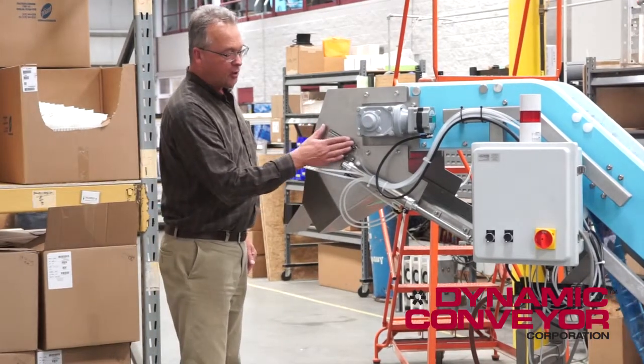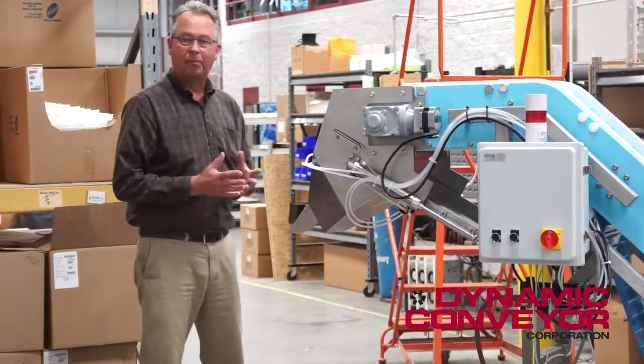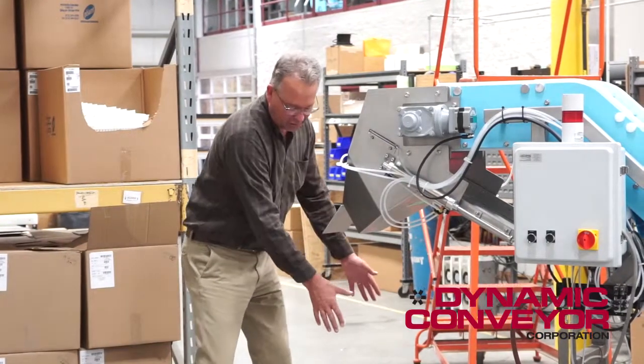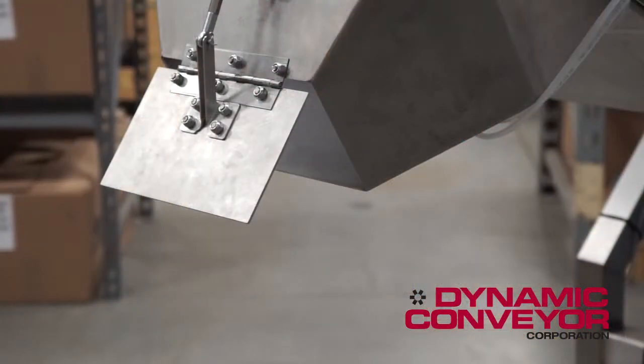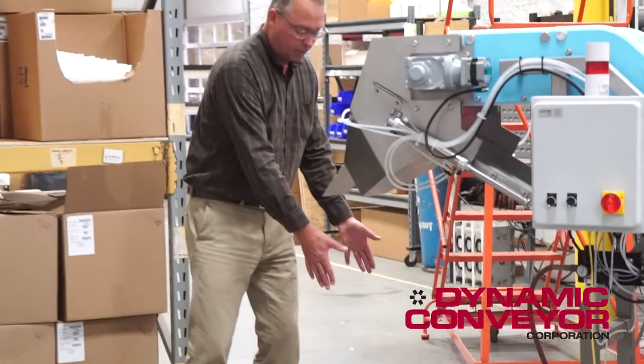As the light curtain counts, once we hit the set point, the boxes have to move. So let's say the set point is 100 — when the 100th part comes through, the boxes shift. But at that point, we have to shut this door, even though they are good parts, and accumulate them until a fresh empty box is down below it.